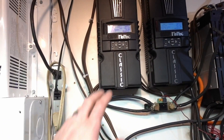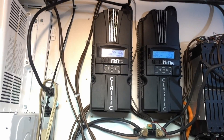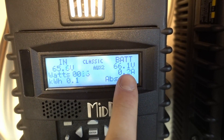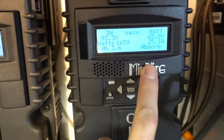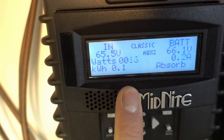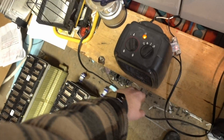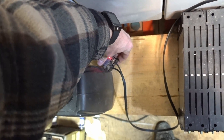Everything seems to be working good. I set my charging voltage 0.3 volts higher to 66.3 volts because the difference between the two voltage readings is always 0.3 volts — it's annoying, but I'll fix it in settings later. We've got wind power coming in and the dump load is actively loading into the heater. All my connections are nice and cool, nothing seems to be getting warm other than the heater. Thanks for watching guys.